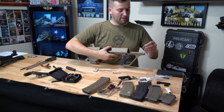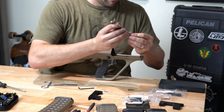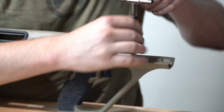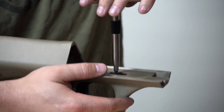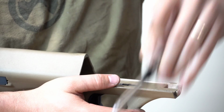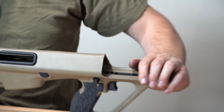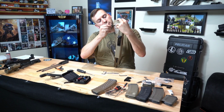I dropped this guy. Alright. Change out the bit. Gonna engage my final set screw. Again, we're just advancing it down until we can feel resistance from encountering the linkage. There it is. Little quarter turn. Done. All it needs to do is engage the flats. So, alright, function check time.